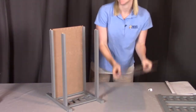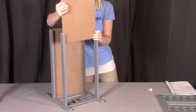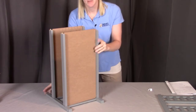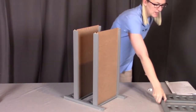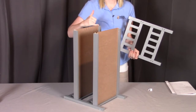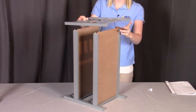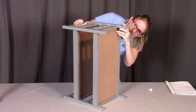Slide all the way down, and do the same thing on the other one. Once you have the panels in place, we're going to put on the last side. The two holes here will align with these rails — the top hole being the dowel and the bottom hole being the screw hole. So I'm going to lay this right on top, put all those dowels into place, and screw all of these down.